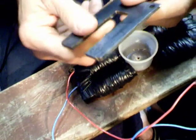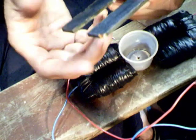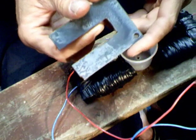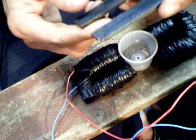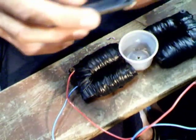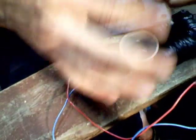And then a layer of tape there. This is just so the sharp edges don't scratch up in there and keeps an insulator between the wire in case the natural insulation of the wire is no good — you don't want it shorting out and ruining your coil. Once you get all that taped up, you start here, leave a little bit of strand out, and then start winding it around on the inside.